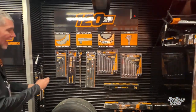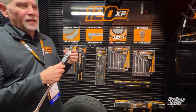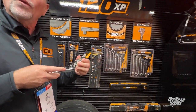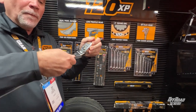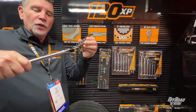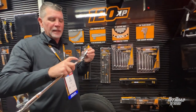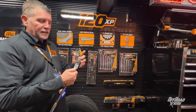On ratchets, we came out with a flex head ratchet. Now it was a little disappointing — it took us a year to correct — but the locking flex heads with the reversing lever would release, it wasn't locked into place, it would bump. So now when you lock that into place with a push button, you're not going to have it come out of place. No more sloppy ratchets. It's just a big improvement with the push button on the locking flex.